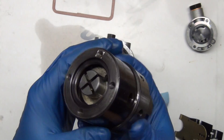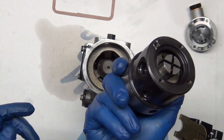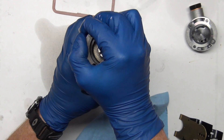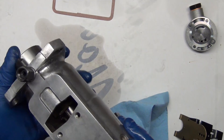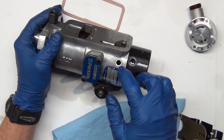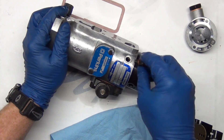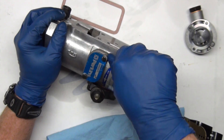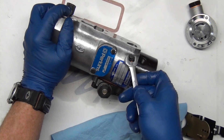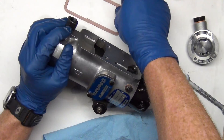This has to go in so that we've got the kill button switch on this side, and the metering valve hole on top so you can get past the O-ring. Just line up your holes right here. This is the bleeder valve that you bleed first — got a new copper washer on that. It's lined up just right and should go in really easy. Probably best not to snug it down yet.